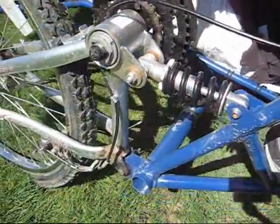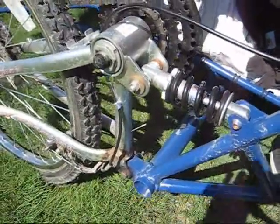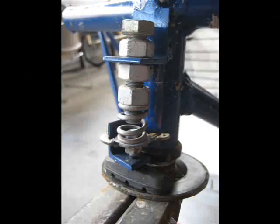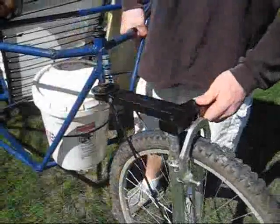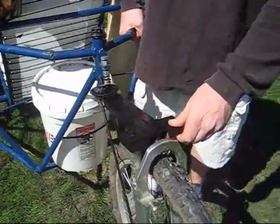An important part of our design is the suspension system for the two front tires. We used two bikes with shocks and bolted them on. This minimizes shock loads for the user while they are traveling on rough terrain. Due to the rear wheel wobble we encountered during testing, a dampener was attached to provide smooth turning and high speed stability.